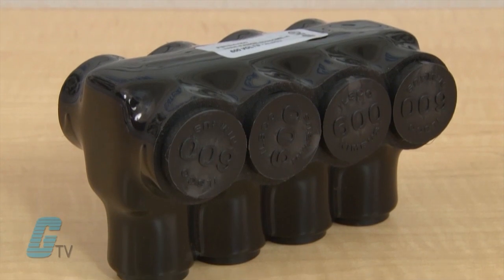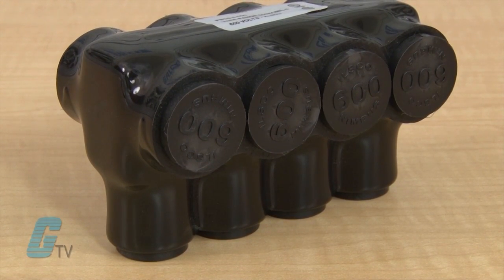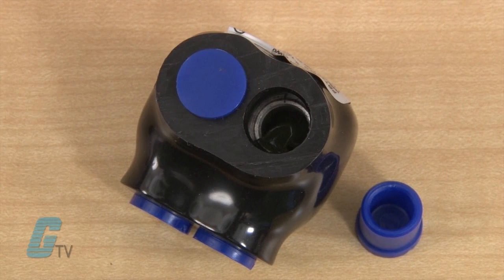The black cover allows for it to be UV rated and they have removable plugs for the entry port closure. The connectors are prefilled with deox to prevent oxides from forming, which can lead to a decrease in electrical conductance.